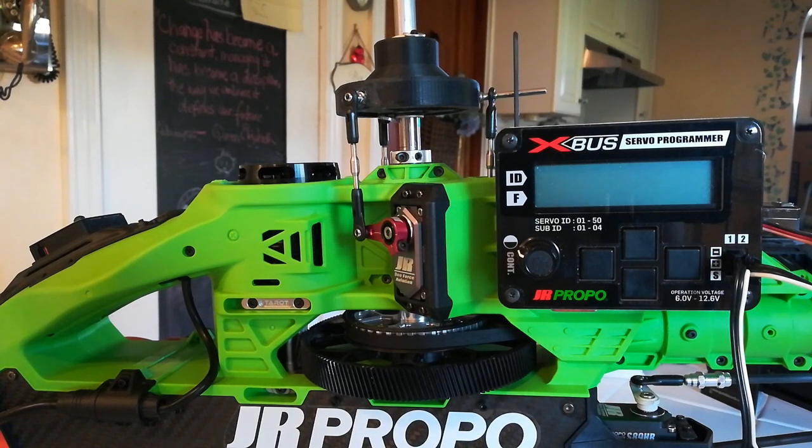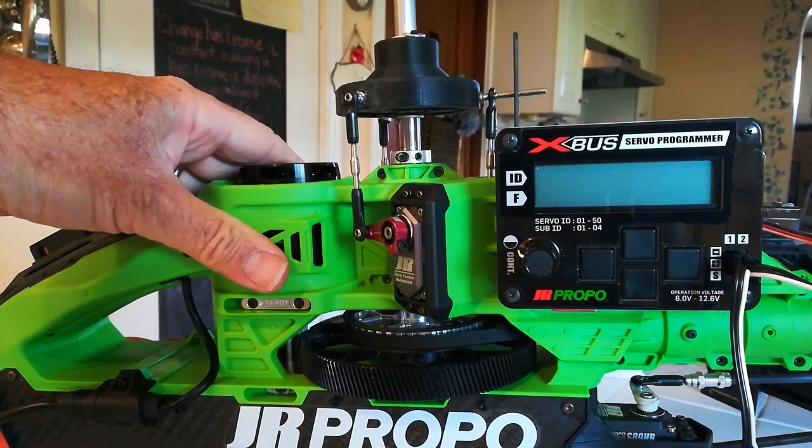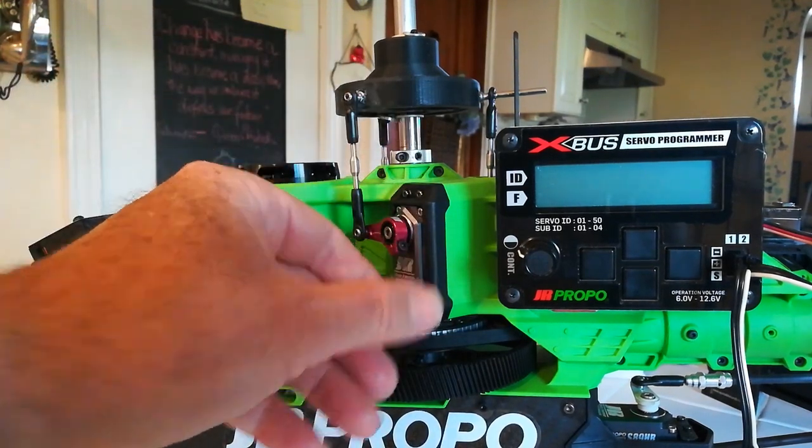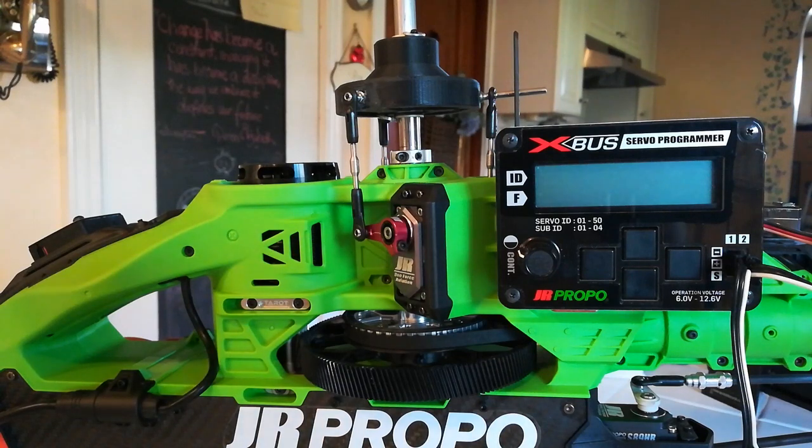In order to get a good sync, you have to have a helicopter with good stiff mainframes, and you have to have servos that are mounted very firmly. If your servos are mounted in grommets, you'll want to — at least for purposes of the synchronization exercise — make sure the servos cannot move around at all.